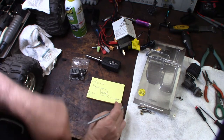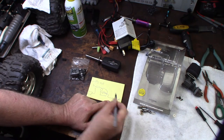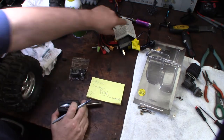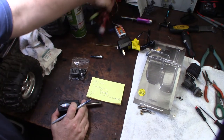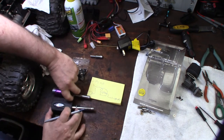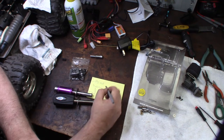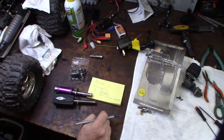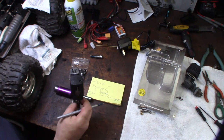Off the battery there's probably another charging circuit where you hook up the AC adapter. That's why I think you can't front-load this thing — if you send 4.2 volts back through the tip, it's going to burn it out. With the NiMH igniter I can front-charge it, but if I try to send voltage back into this LiPo version, it's probably going to burn out the VRM. So you don't want to do that.